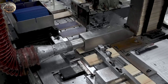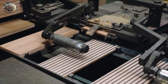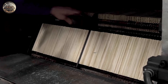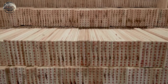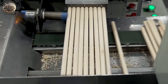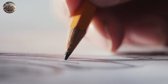The slats without glue are flipped over so that the grooves face down. The two conveyor belts then come together, and each unglued wooden piece is placed over a piece with glue and graphite, making a sandwich. Once taken off the conveyor belt, these sandwiches are squeezed together by a hydraulic press in a metal clamp and stay clamped until the glue dries. After that, the pencils go through shaping machines that give them their familiar six-sided shape, which is popular because it's easy to hold and won't roll off tables.